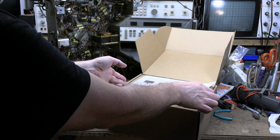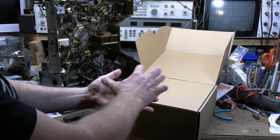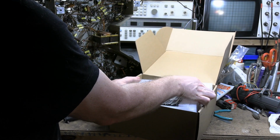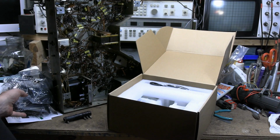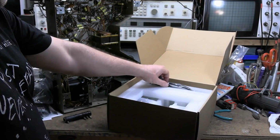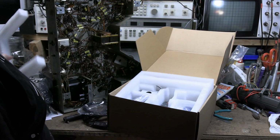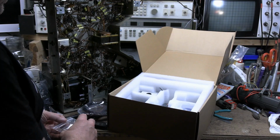I think that is kind of neat. In the past, when I've had trouble reading something, I've taken my phone and tried to zoom in, especially on surface mount parts, and tried to read a part number. Well, this could help out with that considerably. It could also help examine circuits if you're looking for a cold solder joint or a bad part, especially on modern surface mount stuff, but also old stuff. Another thing we can take a look at is silver mica disease on some capacitors, and see if we can actually see what is going on.